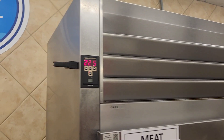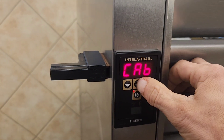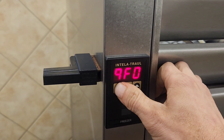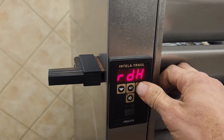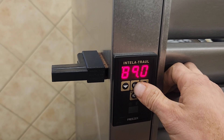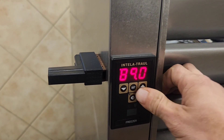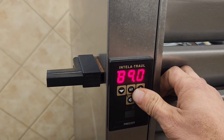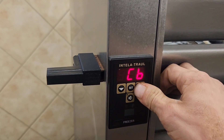So why is knowing all that important? Because watch closely — try to figure out the problem here. Go to the engineering level and go through these parameters. The unit has been on, it has been running, it is below freezing in there, in the 20s. What is wrong with this picture? That's the EL — the evap temperature sensor, the one we buried in the coil. There is no way that should be 89 degrees. It's not.